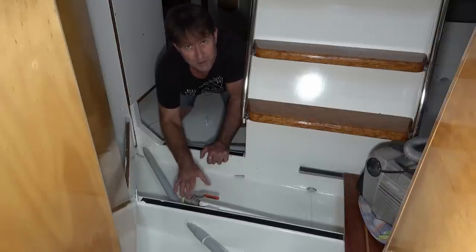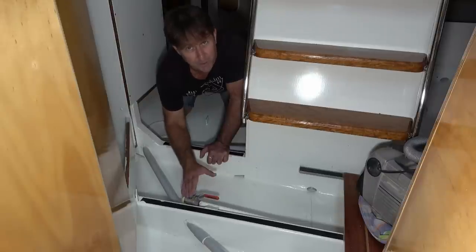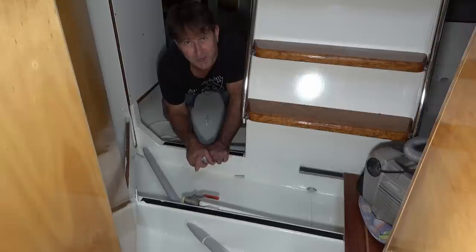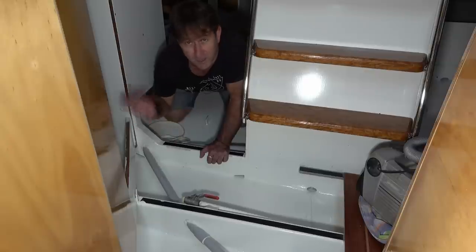All of Mistress's are ball valves, and they're all 316 stainless steel as well. So from this point on, because I can isolate the water with that valve, I'll be using the John Guest-styled plastic fittings, both the hose itself and the fittings. As I say, this is where I start, into the heads, and it'll be beneath that pedestal shelf. And like a lot of things lately, it's great to be moving on towards getting things actually functional and working in Mistress.